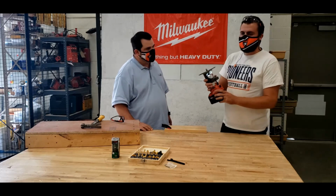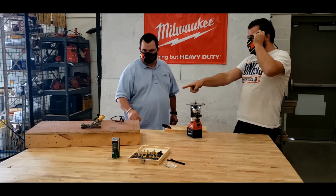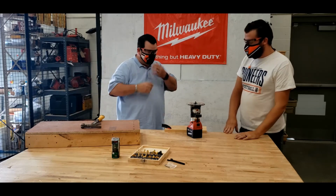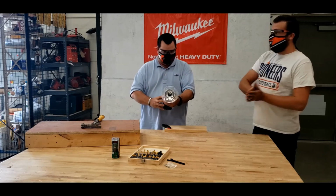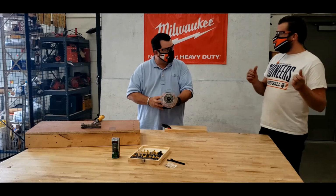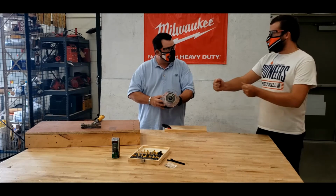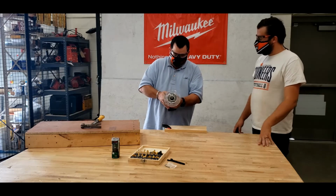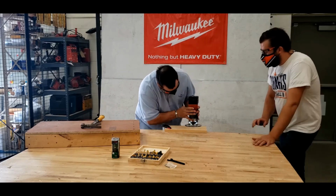Before we get too much further, I remember myself, I gotta do safety first. So safety glasses on, I have a pair for you. I'm gonna let you go ahead and give it a try. All right? When you use a router, one direction is gonna want to pull away from the piece, one direction is gonna want to help guide you, and it's hard to remember which one, so I usually just go, if it feels like it's fighting me, I know that's the wrong direction, so go the easier way. You'll feel as you go. So go ahead and just turn it on. Hold on, it's slowly working over the workpiece there.